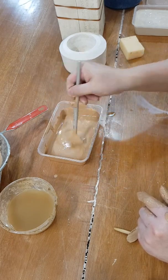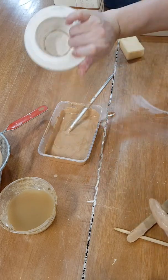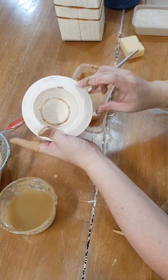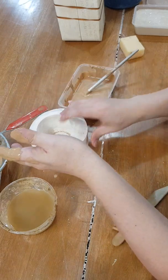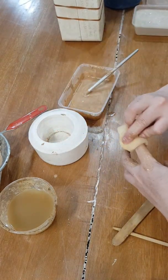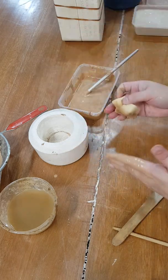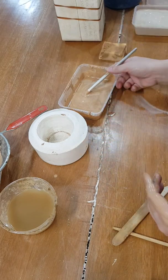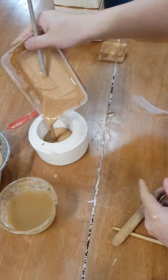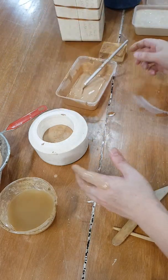Okay, so if I want to remove all these clumps, I can actually screen it again, but I'm just gonna go ahead, all right? The plaster, this is a one-part casting plaster. If it's a one-part casting, the shape has to be so that it has no undercut, right? When the clay actually in there and it's drying, it can pop out. It has nothing to lock into there. Okay, so I'm just gonna start pouring this in here. Okay, we'll see it work.